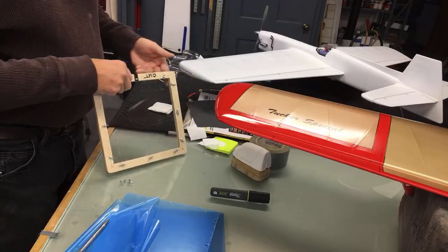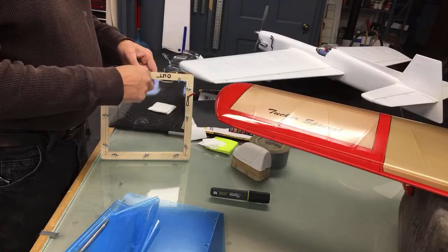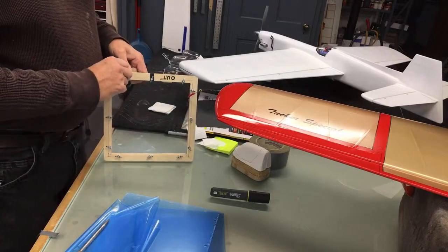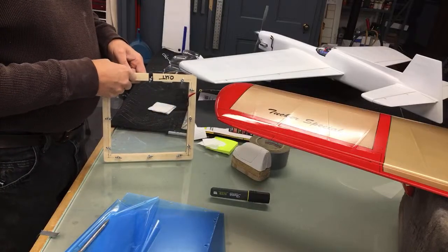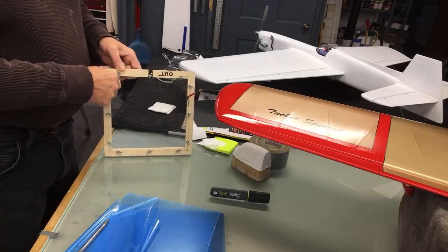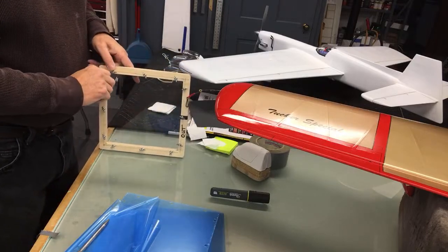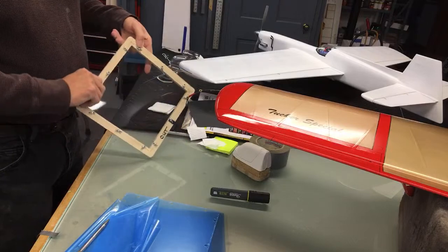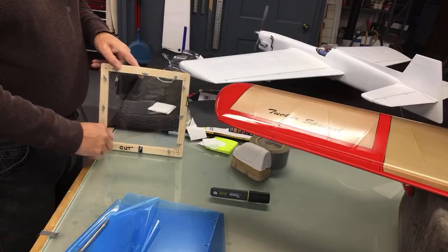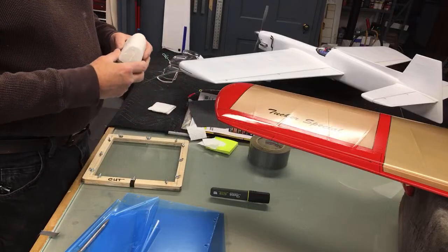I think the little box of plaster of Paris cost me about $6 or $7, and I used about a cup and a half of plaster, and I threw about half that away to make the mold. And the mold, I poured one night, let it cure overnight, and I got to looking at it, and I'm like, well, shoot, that thing's green. It's going to be green forever. So I stuck it in the oven at about 250 degrees, and I left it baking there for a whole day. And it cracked. No, it didn't crack. It just dried it out, which was great.